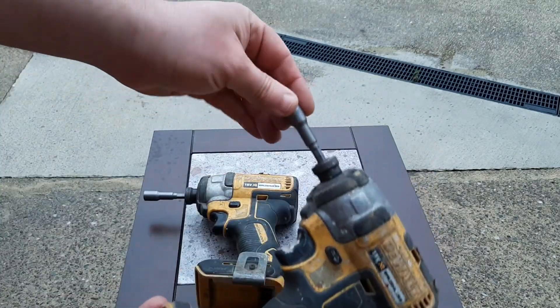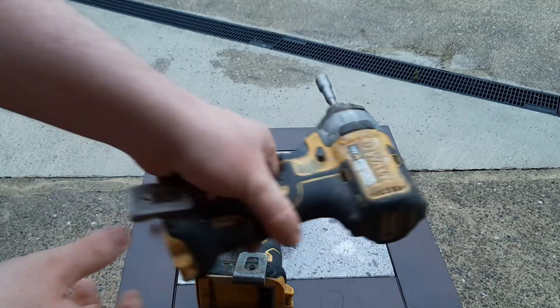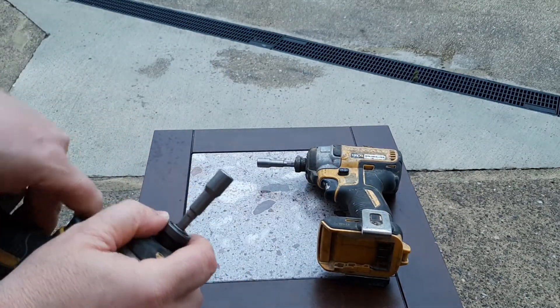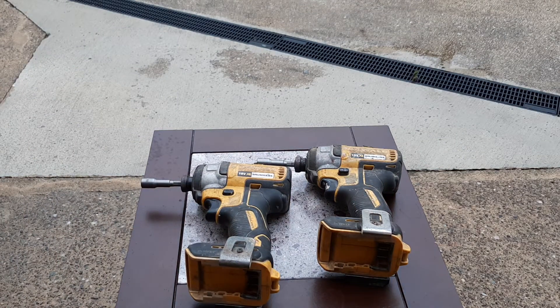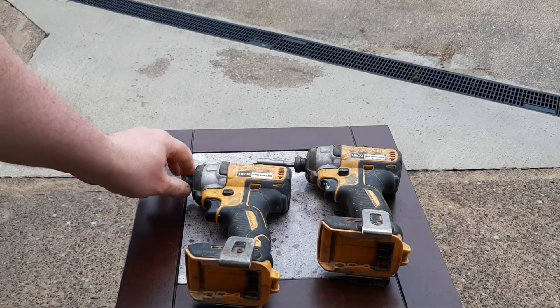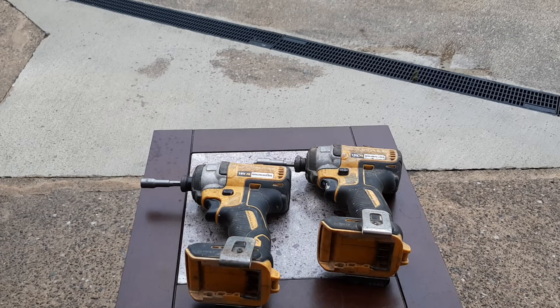Next thing to check — that's why I stuck these in — this is still going, and it is: the collet that retains the bit holder or driver. It is remarkably still intact after all the work these have done. To explain this retaining collet: there's a little spring, it holds a ball in place, and that can get broken if there's excessive wear or refuse. It's a very, very common issue. There is a video on my channel showing how to repair this if it happens, but it's an older video and less sophisticated than my more recent attempts. Anyway, the collet is good.